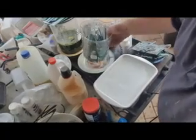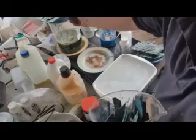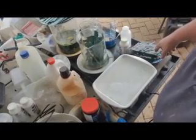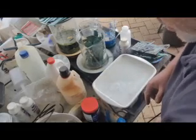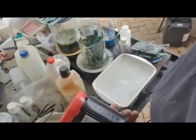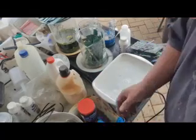All right, so all the boards have been soaked in hydrochloric acid. They've all been rinsed off. And they're ready for the nitric acid, but I'll do that later because I've still got those other boards to do. So in here I've got water and sodium hydroxide, drain cleaner, otherwise known as caustic soda or lye. I don't know the exact quantity that you've got to put in. Doesn't really matter, I suppose. I've just poured half this container in, and this is a 500 gram container. Probably too much, but I've got plenty of it, so it doesn't matter.